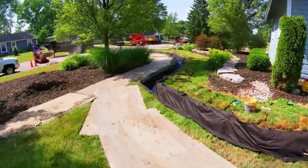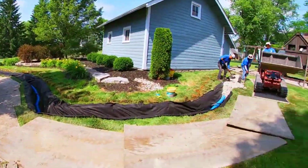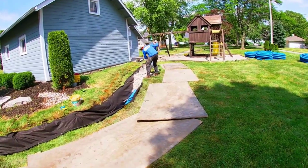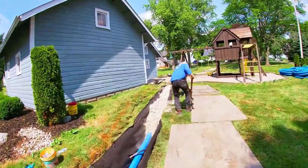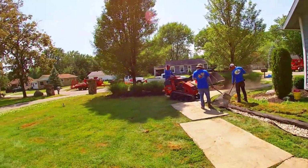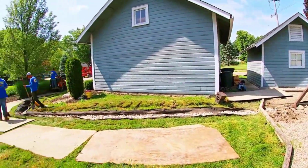So the byproduct of getting this good quality stone through that process of screening, the pea stone and sand, is what they're trying to get rid of. It literally is the cheapest material that you can buy and use for anything, whether you're mixing concrete with it or making, say, exposed aggregate concrete patios that are beautiful. Actually, that's where it belongs. That's where it shines. But everywhere else, it kind of sucks. It's not very good for drainage, and it's just the cheapest thing. They're damn near giving it away.